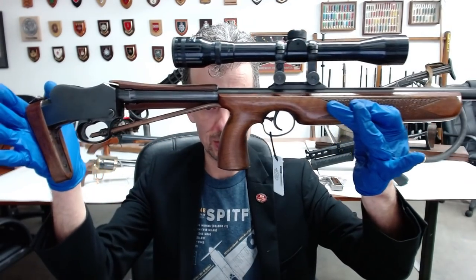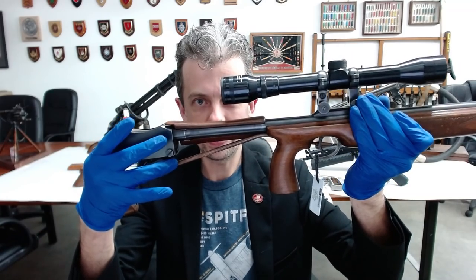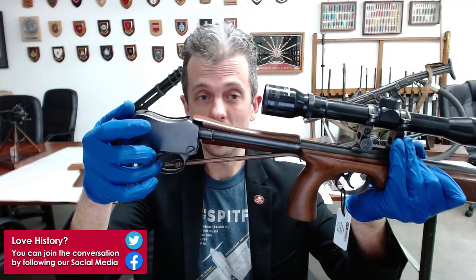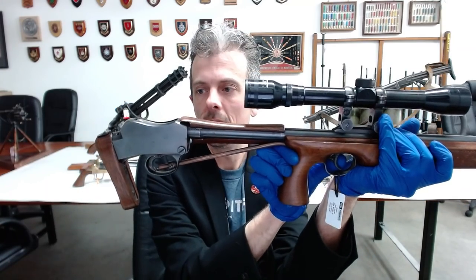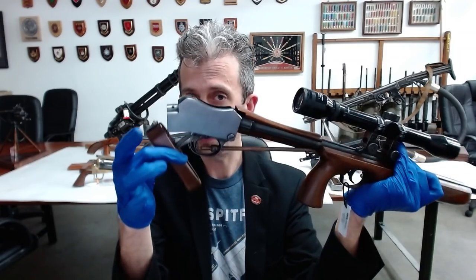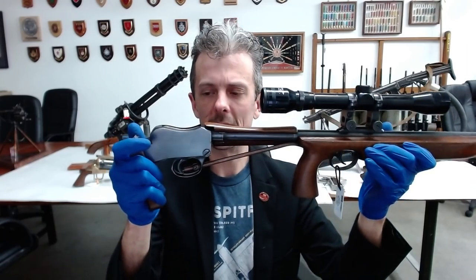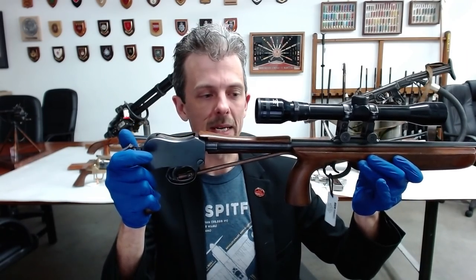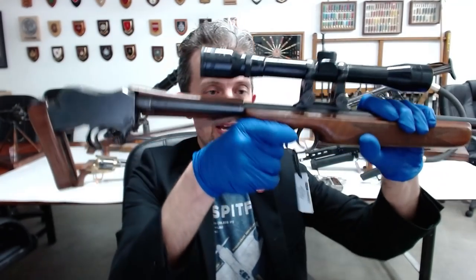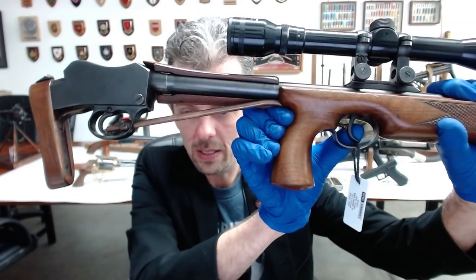Now, this is just brilliant for illustrating what a bullpup is and how it works, because it wears its heart on its sleeve. What would normally be a connecting rod or bar hidden inside a properly designed bullpup, on this conversion, is exposed for all to see. The original trigger on the Martini action is still there. To load it: press the catch, drop the buttplate down, insert your single cartridge — no magazine on these — close it back up. You'd then be chambered, cocked, ready to fire, and rather than pulling the original trigger, you pull the new front trigger. There's a linkage, and you can see the connection there.